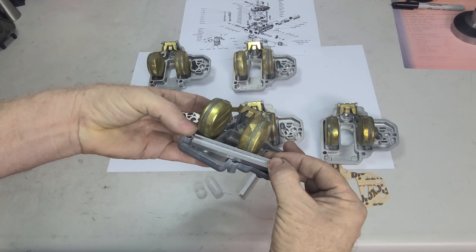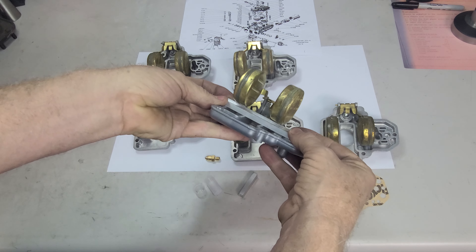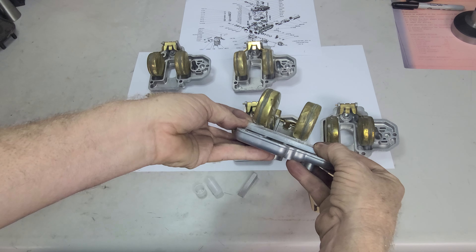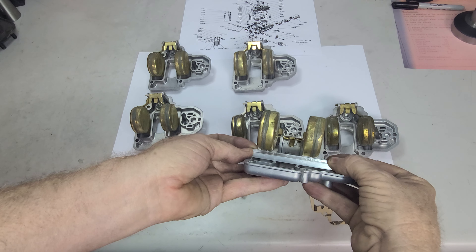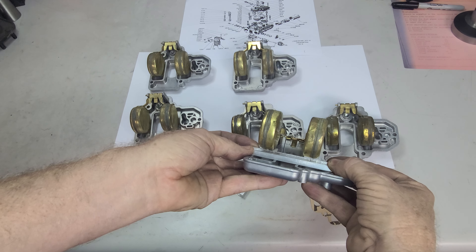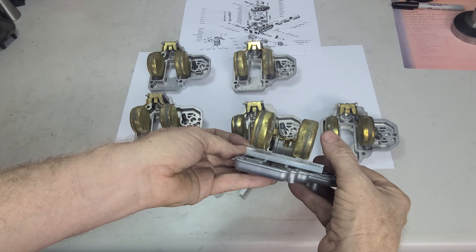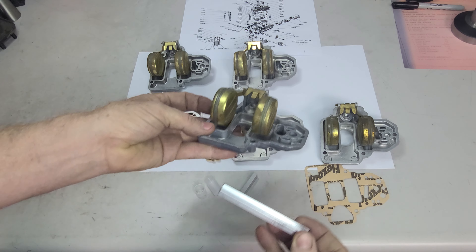Okay, let's go with this one. We'll put this under here and get it set. What do we have? The right float is high and there's a slight twist to it. Since this is high on the right side, I'm gonna also take care of the twist — so that one needs adjustment on that side to match the other side.